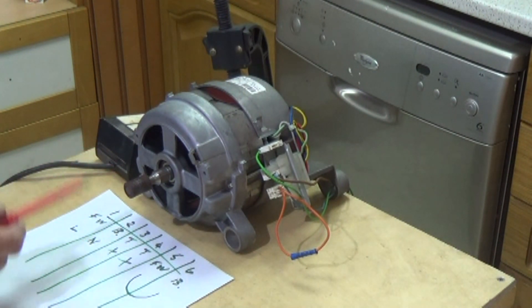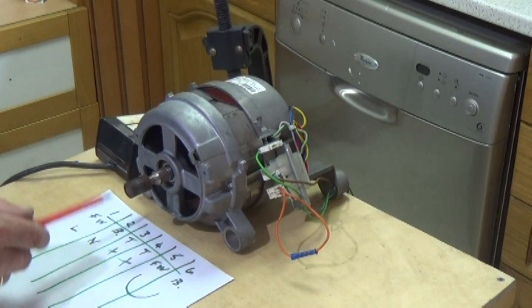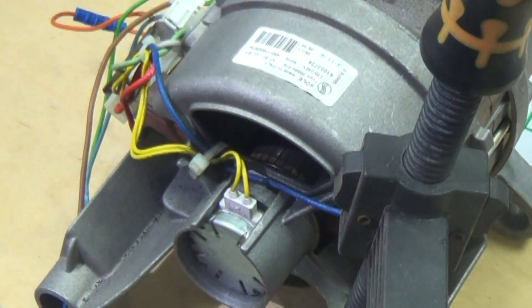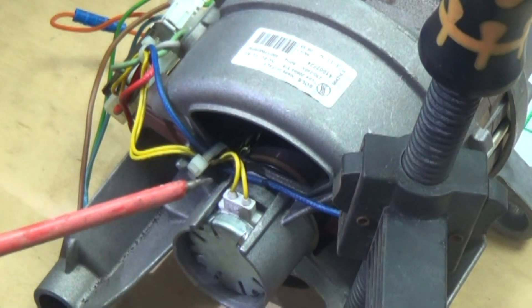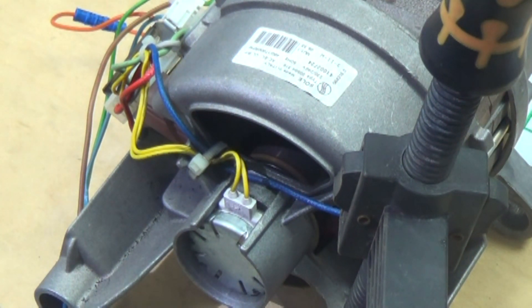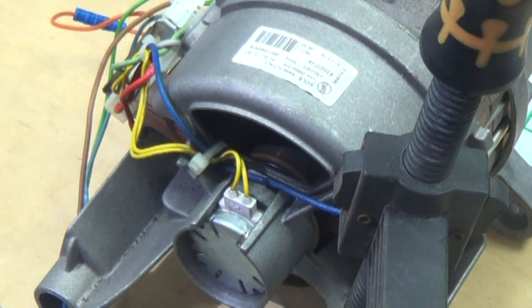As you can see, the way we've got it configured the motor is turning anti-clockwise and it's running nicely. I'll just show you the commutator at the back — you'll see some sparks but not many coming from the one brush. That's perfectly normal. If you do have a lot, you could have a problem with your commutator and you need to get it checked. I'd already fitted new brushes to this machine.